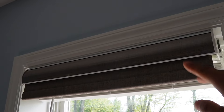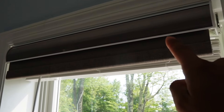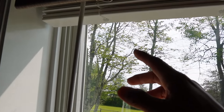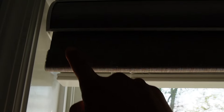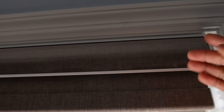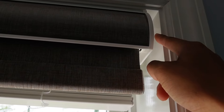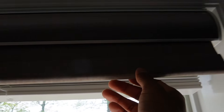If you're ordering these blinds, you have to measure the size correctly because they're custom made — you need the width and the length. The length is self-explanatory, but I got confused on the width. I measured 28 and 3/8ths but didn't know which part it referred to. It turns out it refers to the outer edge, so I should have measured from this side to that side to cover as much as possible and avoid gaps. But that's fine — now I know for next time.